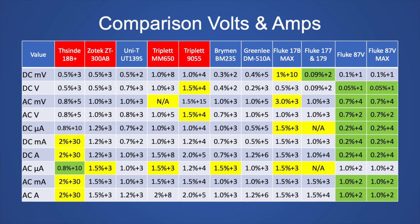This is a chart comparing the voltage and current accuracy specifications in the manuals of each meter in the 6,000 count group. A red background for the meter name indicates no third-party testing information. Green squares point out the highest or most stringent specification, and yellow squares point out the least stringent. I believe specifications in the manual are very important because that's what the manufacturer says the meter will do. Many meters perform closer to accuracy than their specs, but if a meter is out of spec and you want a replacement, the manufacturer won't replace it if it technically meets the manual's specifications.